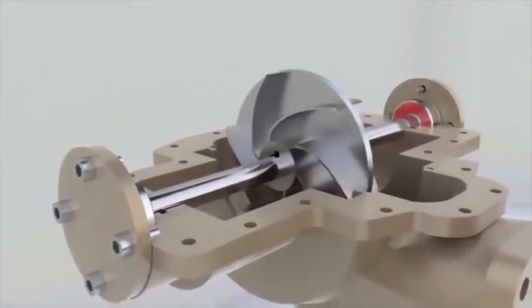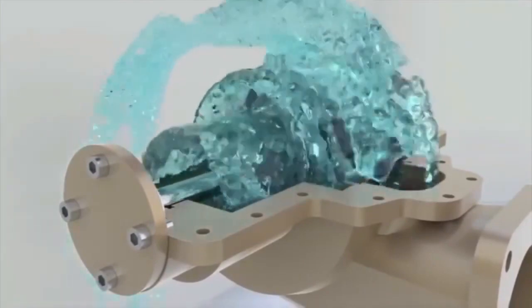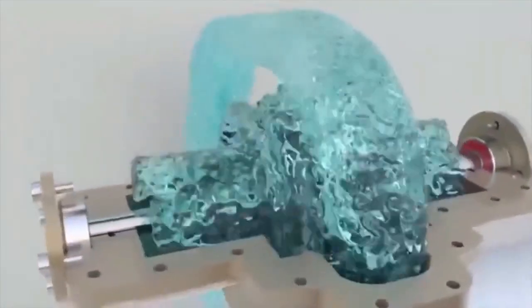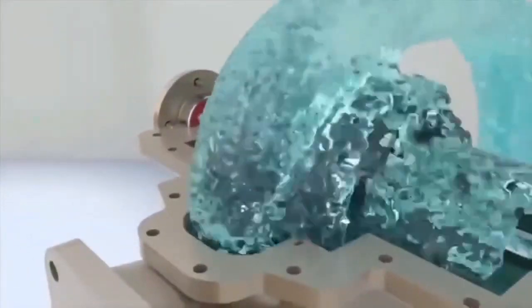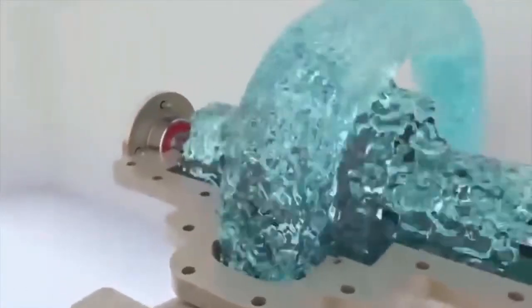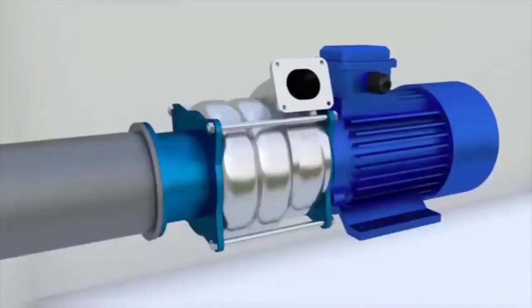This construction scheme is well suited for double suction impellers, where the vanes are placed on both sides. A double suction impeller allows liquid to enter the impeller blades from both sides. Thus, we have two pumping units without significantly increasing the weight and dimensions of the pump. This scheme is relevant for pumps with high capacities because the pumping units are installed parallel.